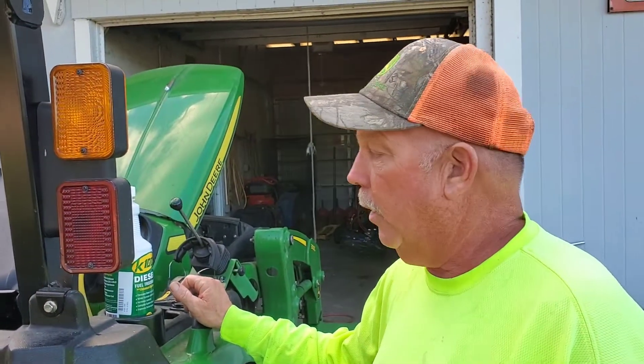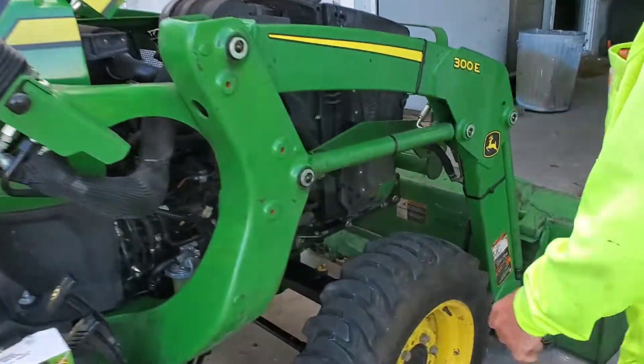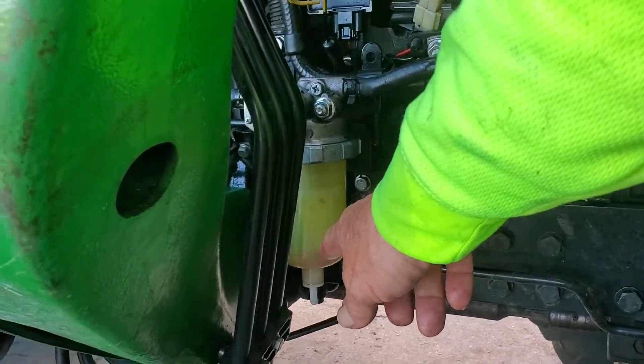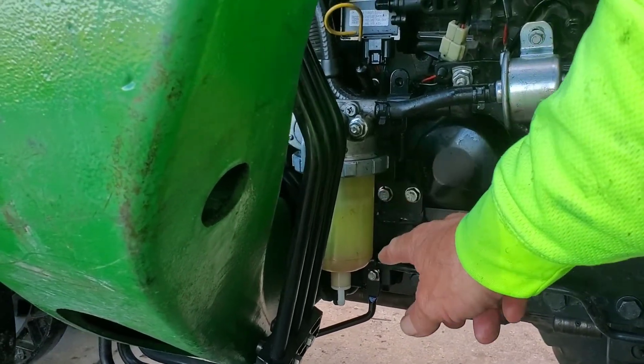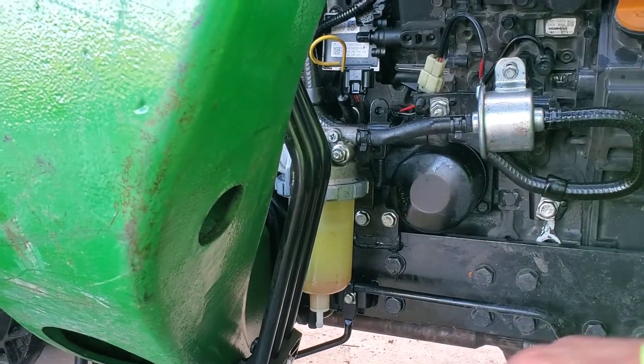This tractor is new since June so I've only had it since June and this is December, so I didn't really think I'd have sediment in my tank. But when I cleaned out the sediment bowl — which I showed on a different video — I had sediment in there. If you have a bunch of black dots and stuff in there, you probably have contamination in your tank. I don't know how it happens — maybe from the fuel pump station or wherever you bought your diesel — but anyway, before you change out your fuel pump make sure you've got flow from the bottom of your fuel tank, because it may just be a sediment problem.